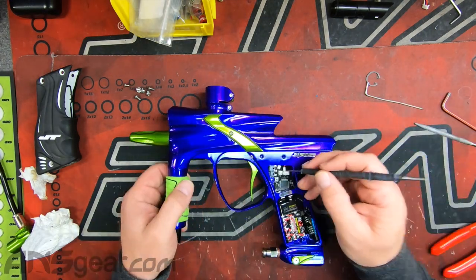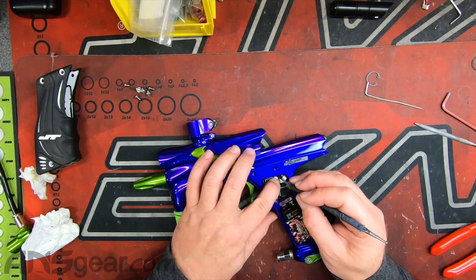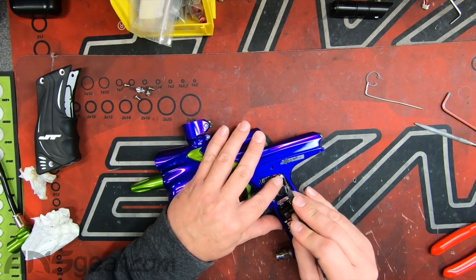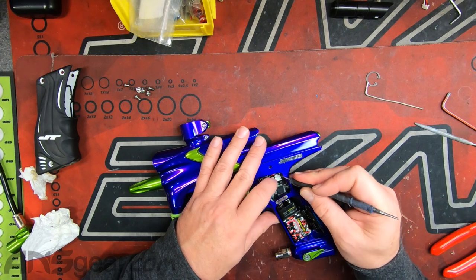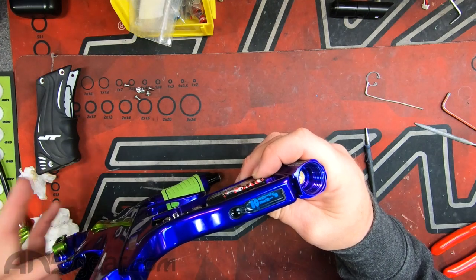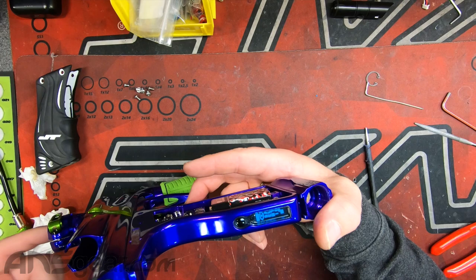All right, so now we kind of got to tuck our wiring in there. I'm going to try to move that wiring because we got to turn this one. I tried to turn it beforehand, but it kind of wanted to go back. There we go. Now let's look. Got an open eye, closed eye, open eye. Closed eye, open, closed, open, closed. Doesn't shoot. Shoots and then goes to eye fault, which it should, because my finger is still in the breech. My finger hasn't cleared the breech, so it thinks my finger is still in there.